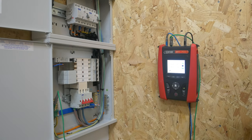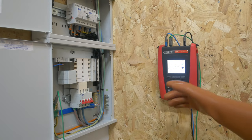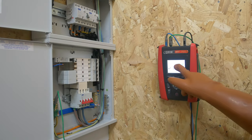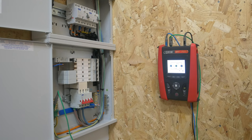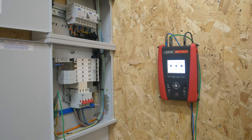We can look now to test the RCD. First up is the set up of the instrument — you can see here it's given us the option just to run an auto sequence, but you can do an auto sequence and a ramp test as well. We're also going to do the 0 and 180 degree nominal values. And these gloves are pretty decent — they're working through the screen. We need a three-probe setup again — protective earth, neutral, and line. I'll repeat this test three times across all of the three phases, just to make sure the RCD up front operates.